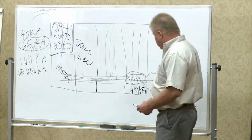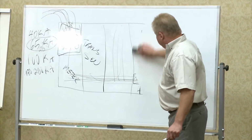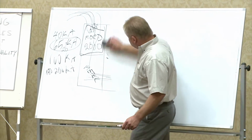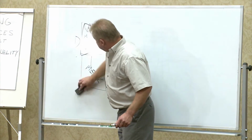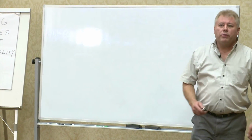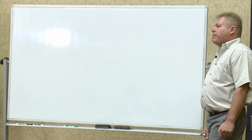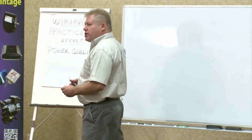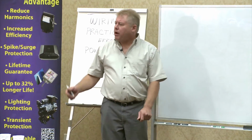Now, over the years, most of this started with customer feedback. It wasn't anything I was looking for, but people were coming back and saying that they were seeing strange things happen. They were saying things like, the power company came out and changed their meter. And well, why would they change the meter? Well, they think there was something wrong with the meter. And most of these scenarios happen to do with power factor. So I started investigating what's up with CleanVolt and why is it helping correct power factor.